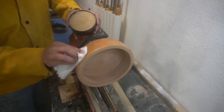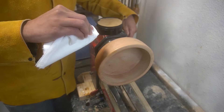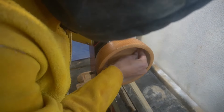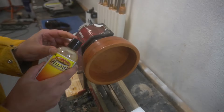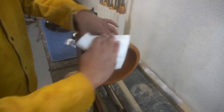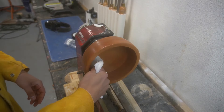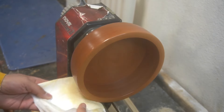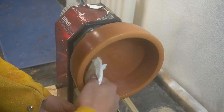Now we're using some Yorkshire Grit and you're really going to see how well this wood pops — the grain and the color look really good. I'm just pasting it on and you can see the grain come out once you apply the abrasive and give it a spin to work it into the wood. Then we came back and finished it off with some Shellac Wax to give it a good shine. You can already see that reddish-orange-brown coming right through — it looks absolutely beautiful.